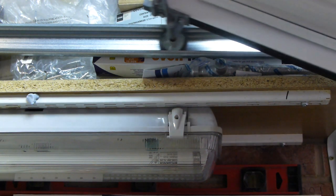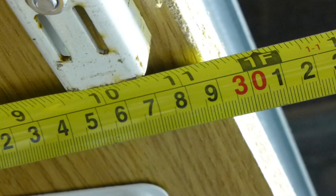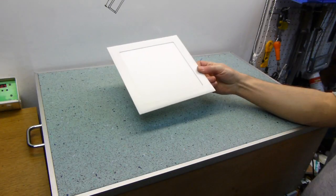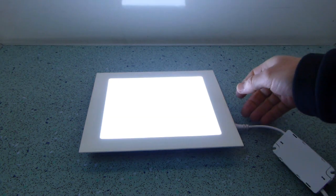So that's why I wanted to replace the light. The difficulty I had was the runner for the up-and-over garage door runs right where the light is going, meaning I've absolutely no more than 29cm to play with. After some searching, I settled on 18W LED panel lights. These are 225mm square, so they fit nicely into the space available, and they seem pretty bright and evenly illuminated.